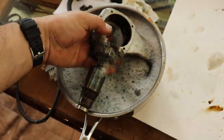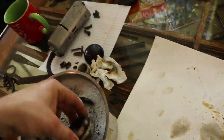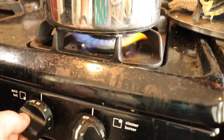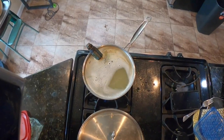Just pushing out the old wire assembly and disconnecting the ground, and we'll be ready to move along. So now everything needs to get clean. What I did was use soapy water — just Dawn dish soap concentrated in some water — and I boiled it, got it nice and hot. It got all the castings nice and warm and made it really easy to scrub all the old crap off. I think it was mostly gear oil and grease caked on there.